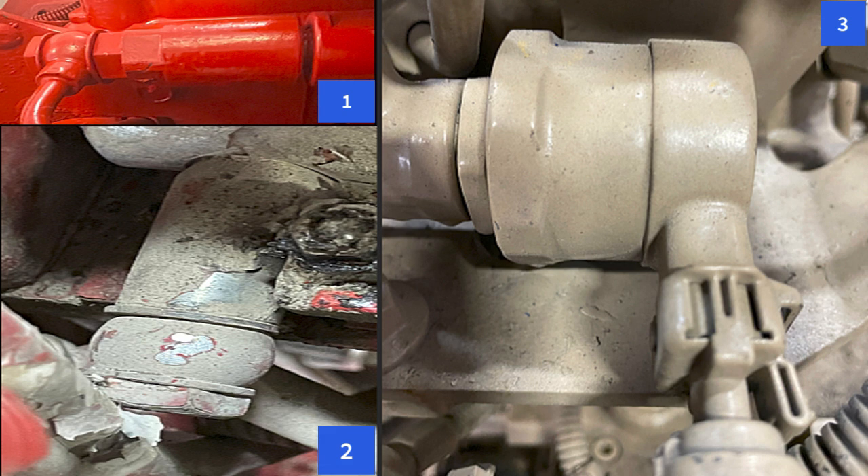I haven't run across anybody that can tell me why they use that instead of the other mechanical type, but I'm sure there's a reason. Relief number three — if it fails, you're always buying the entire rail assembly; you cannot buy that relief separately. Number two, if it's got the end plug that screws out, you can buy that separately — just put your engine number in and go to the parts screen to see what's available. Thank you for your time and for subscribing to Engine Shop Joe — see you next time.